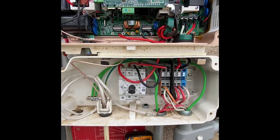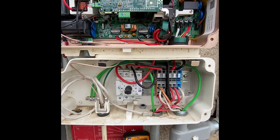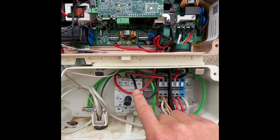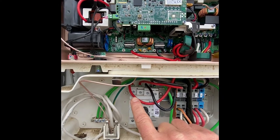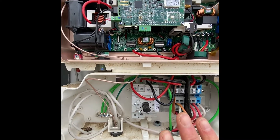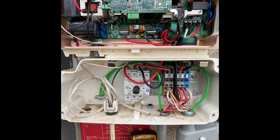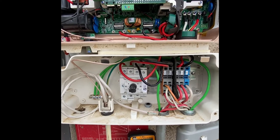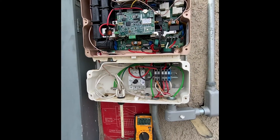A way to troubleshoot this — I'm not saying this is something you should do, but if you want to use some common sense — you can put your negatives in the tops and your positives both in the tops over here, just to see if that's the problem. This will kick on. You'll have to repair it on your SolarEdge commissioning app, and then everything should be better. Thanks for watching, please subscribe.